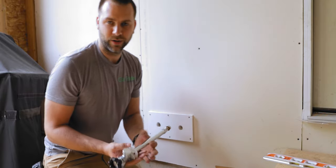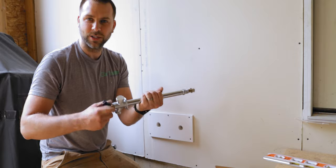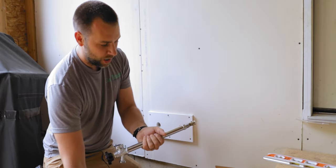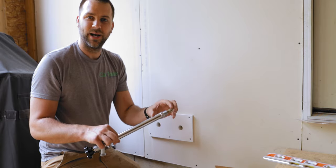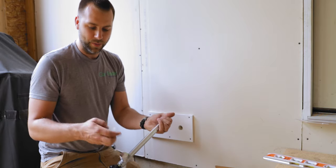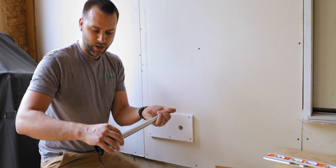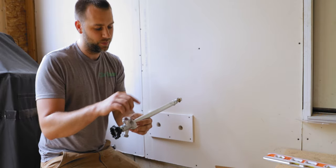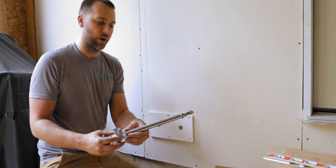So basically how these work, they're just little two pieces here. The way it works is that the shutoff knob is here, obviously, but it actually shuts the valve off way back in here. And that's so that this part is inside the house where it's heated, you don't worry about it freezing. And then this little bracket shim here goes on the top here. Basically what that does is just make sure there's a little bit of slope downward. So when you shut it off, any water that's in there will run out.